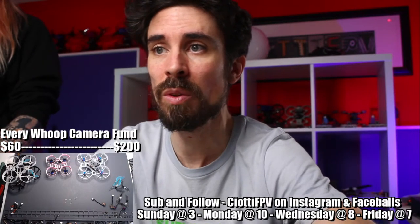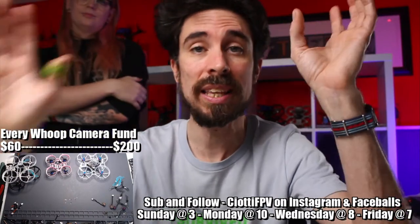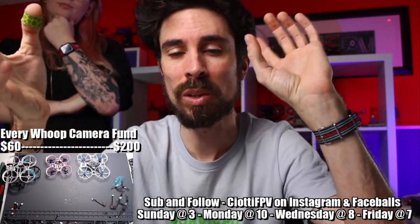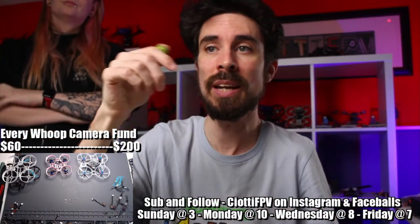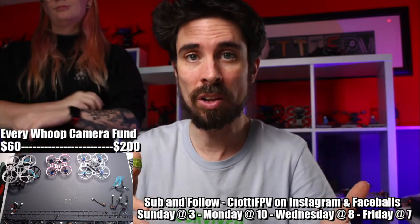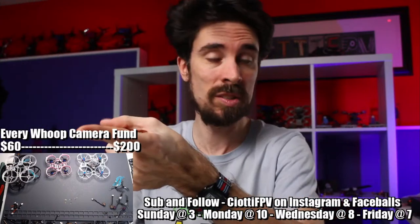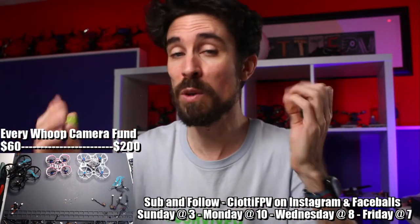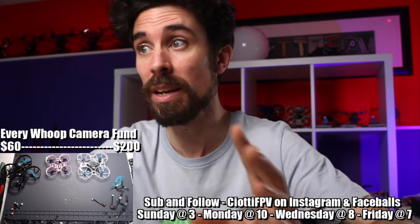And then, with the RunCam Split cameras, what you're going to get is slightly less field of view than you're used to, and slightly more latency than you're used to. But you're going to have onboard DVR in HD that looks awesome. So if you're on analog and you're not on Walksnail or HDZero, this is the only way for you to get HD. And if you can get over the extra latency and the lack of field of view, it looks great for what it is.